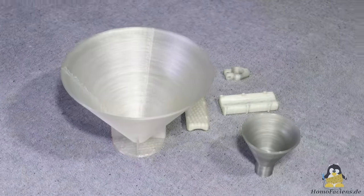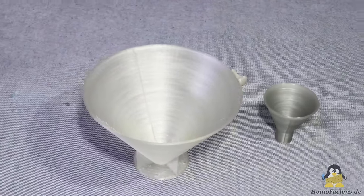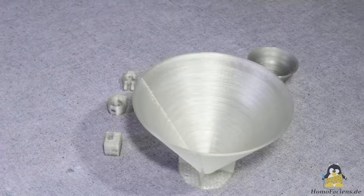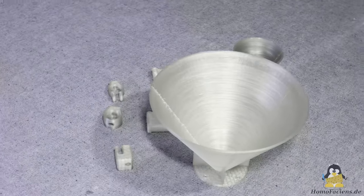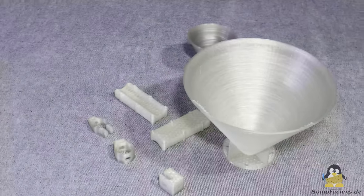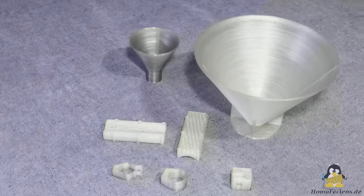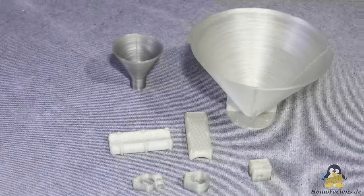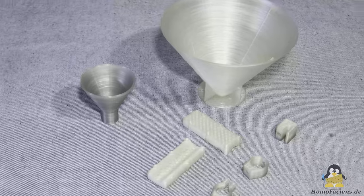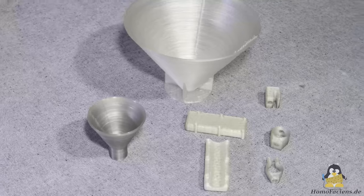The printed components are of good quality and can therefore easily be used to upgrade the Prusa. All components were printed with a layer height of 0.2mm. The maximum speed for the 25% honeycomb infill was set to 40mm per second, and all other structures were printed at 30mm per second. The extrusion width was 0.7mm during all prints. These are my standard settings for 3D printing, which I also use to create the orange upgrade parts of the Prusa with a filament printer.